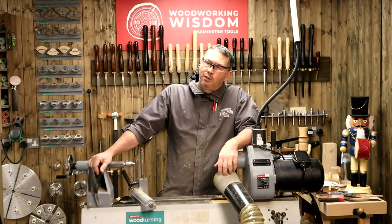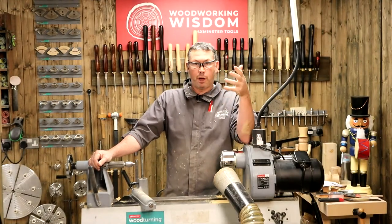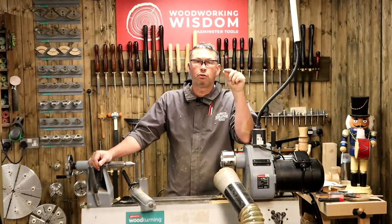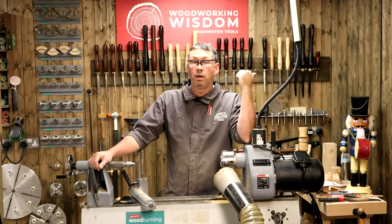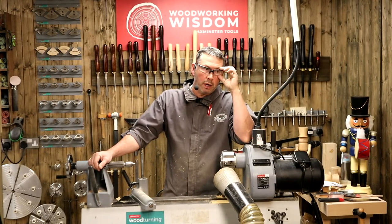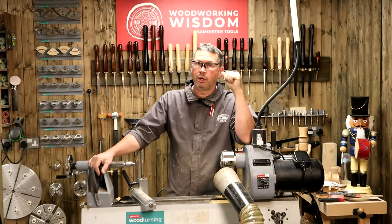Yeah, absolutely. I haven't. No, I'll tell you why. It's simply because that butt joint with epoxy is so strong. I've tried to break those before and broken the timber without breaking the glue joint. It's that strong. So I would certainly recommend that. And so it's a step that I didn't need to do. No, I understand where you're coming from now.